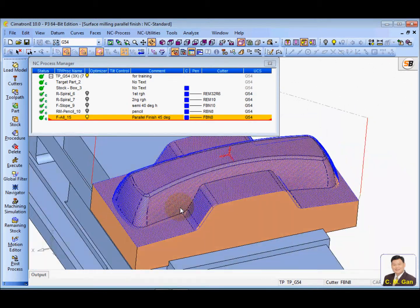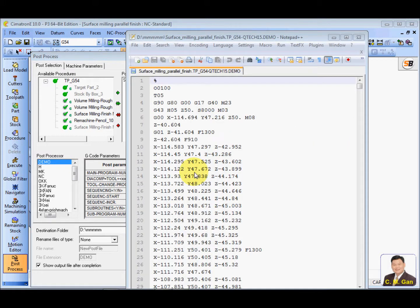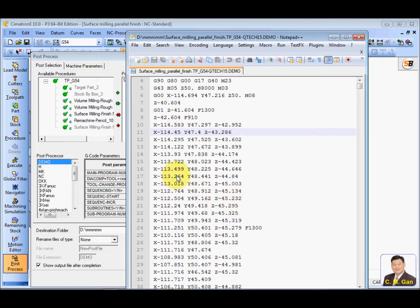One thing regarding 45 degrees — let me show you the G-code. If your machine runs at 45 degrees, that means it will move X, Y, and Z — three axes at the same time. This makes the machine run slower because it is slower to move three axes simultaneously, and the accuracy is not as good compared to two-axis movement. Three-axis movement is slower and less accurate.